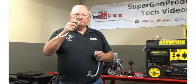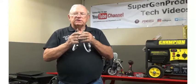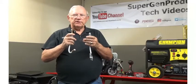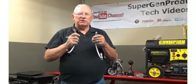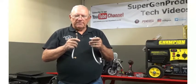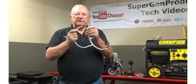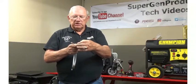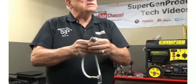They also come with two different fittings: one is a 12 millimeter thread for generators larger than 224cc, and also a 10 millimeter thread. Many people make a mistake of assuming that the size of the wrench that removes it is the size they need to order. You're actually going to order 12 millimeter for the larger generator, and that's going to have probably a 14 millimeter drain bolt. The size of the thread — the 12 millimeter — is measured across the face of the diameter.